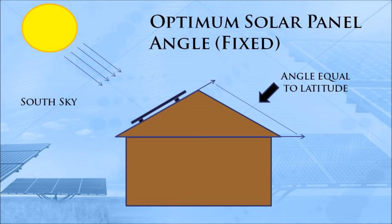The second thing is the angle that the solar panel is mounted needs to be roughly equal to the latitude of where you live. That way you'll get a nice compromise between the sun during the summer and the sun during the winter.